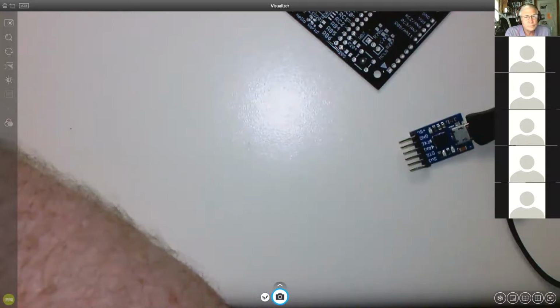All the surface mounted devices will already be on the board. We just have to do the through holes. That's correct. Okay, thank you. Yeah. And I don't have a wave solder machine, otherwise we could expedite the through holes, but we don't have that handy. I've thought a lot about trying to figure out how to get one, but they're like $100,000 kind of stuff. They're very expensive. Okay.